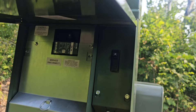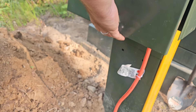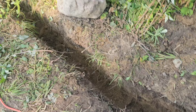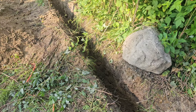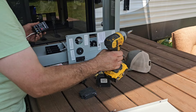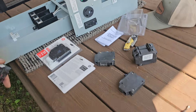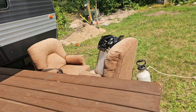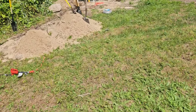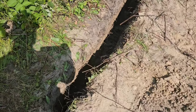This is what comes from the electric company — it came with two 15 amp outlets. So I did have some power, but I needed to put in this pedestal so I could get a full 50 amp service running to the trailer. I'm taking out the breakers that came with the box and putting in GFCI breakers to meet what the state requires, because now it has to be GFCI rated even for pedestal boxes, or what they call temporary power.